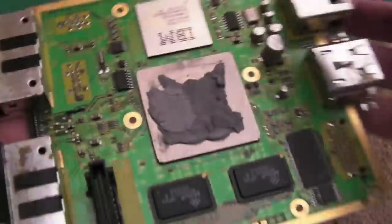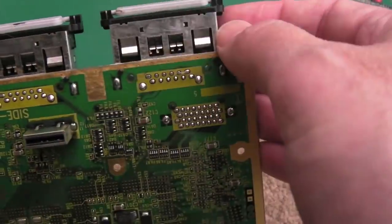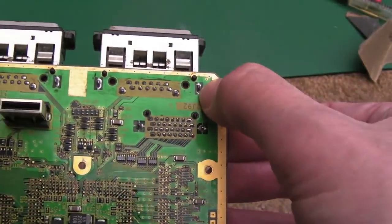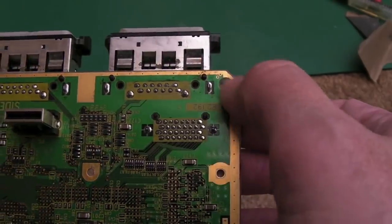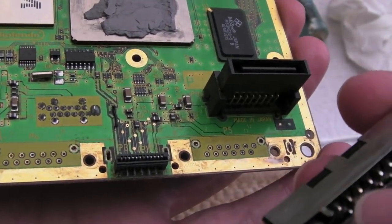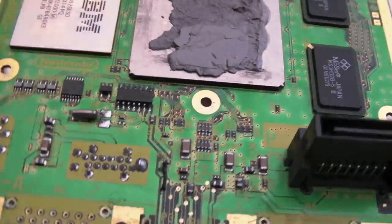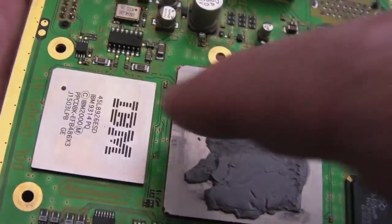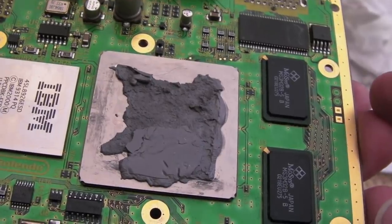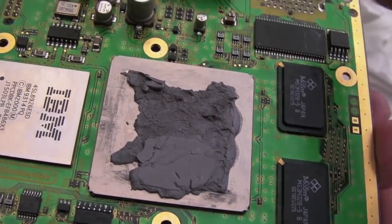The other thing that crossed my mind on this original board — the one that doesn't work at all — is that there was a lot of corrosion around here. I wonder if some corrosion's got under these things here and is shorting out something to ground. Could be a data bus connection or something. So I'm going to try and remove these — they don't look that difficult, it's just the anchor points that might absorb a bit of heat. We'll remove one and just have a look underneath. So I removed the controller ports — you've got to be quite careful, on the other one one of the pins snapped off, but I can fix that. It was very dirty under it, there was corrosion — I've cleaned it off, but it's not made a difference, it still doesn't boot.